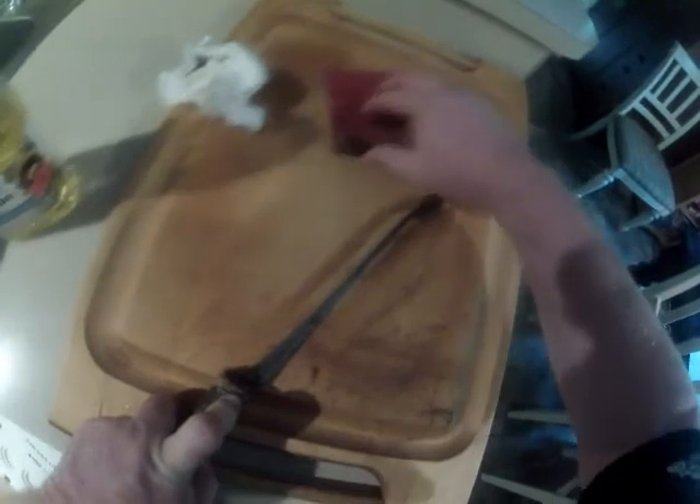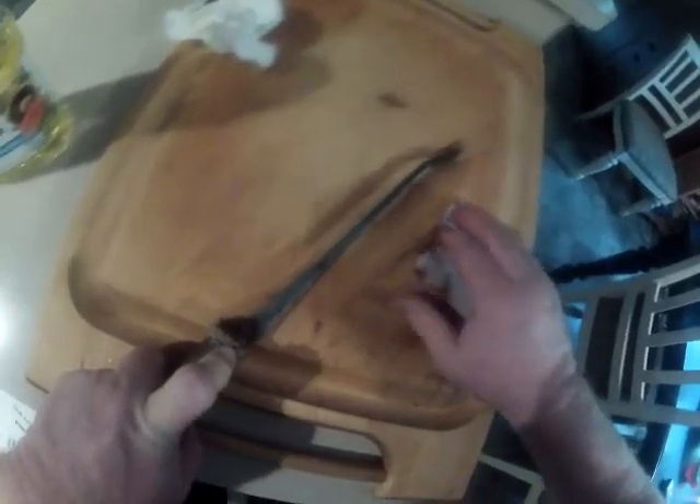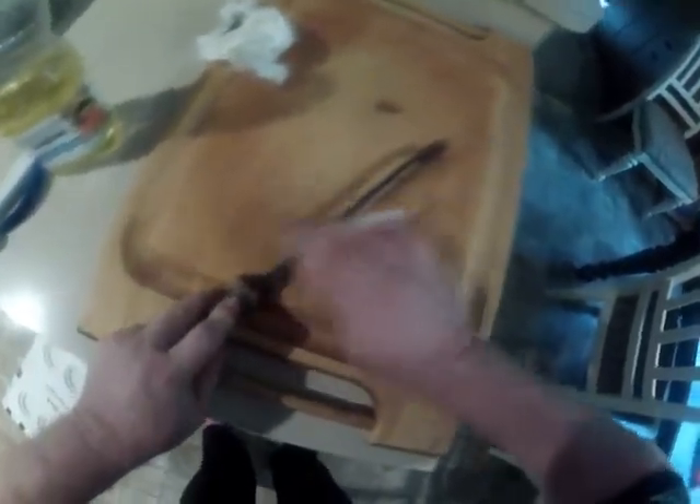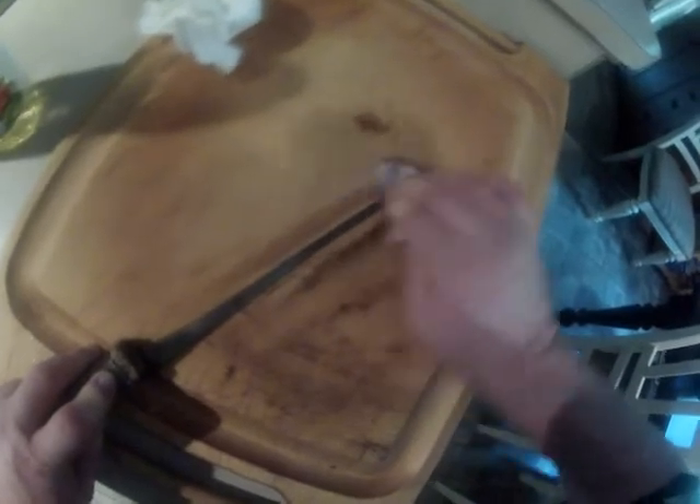Keep these blades oiled, or do this if you haven't used them in a while. Today we're already starting to take a lot of that corrosion off. It'll take a while — you'll never get it up to a new finish. It's got some pitting in it. If you've got a triple-edge stone that's real wide, you can run the blade on that. Just don't want to cut into it with a regular motion — you don't want to hit the edge too bad. Both sides are getting cleaned up pretty good.